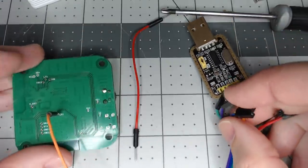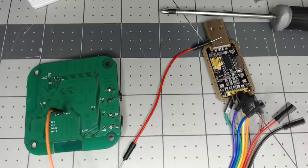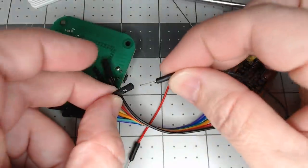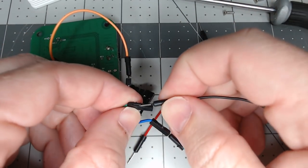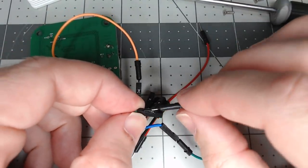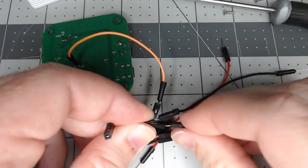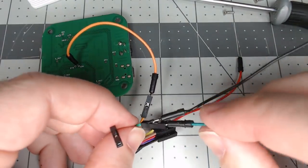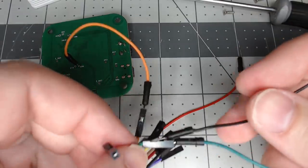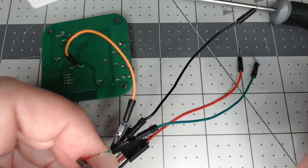Now you have that pin connected. Repeat the process: TX to RX, 3v3 to 3v3, ground to ground. For GPIO 0 up here, if you don't have a little splitter, you can strip the wires back and tie them together. For ground, once you push your ground in here, pry up the little clip and stick the breadboard jumper in there - it will stay put. Now you have a kind of split. It's not pretty but as long as it has continuity you're only going to use it for about a minute, then undo all this.